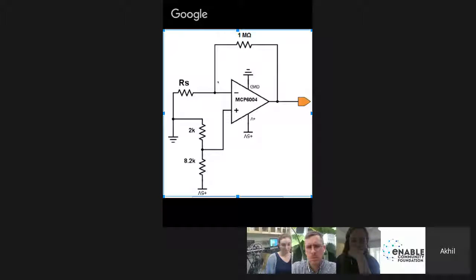Right now we're having a little bit of difficulty figuring out what components... we're trying to figure out if something was misplugged, or if something's broken. To do that, we're going to run a positive control with just one sensor and one input voltage, and assemble one of these diagrams, because in the final design we have about 20 of these sensors being fed into a breadboard. So we're just going to simplify the problem to one, and see if we can get that to work, or if there's an intrinsic problem with how we're approaching this.